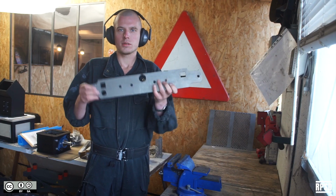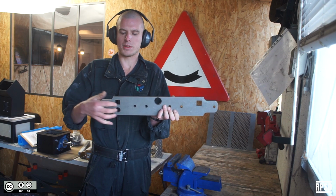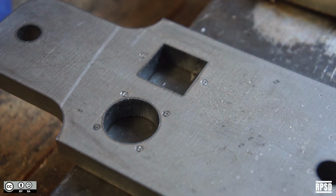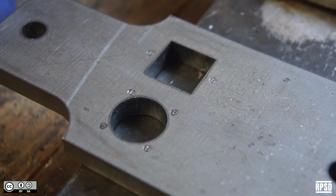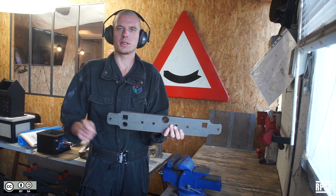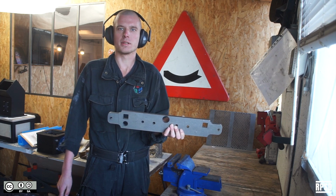You'll notice that on one of the end plates there are some extra holes marked for the electronics. Around each of these holes there is a center mark. Mark all of these centers with a center punch and then drill and tap them with an M3 thread.